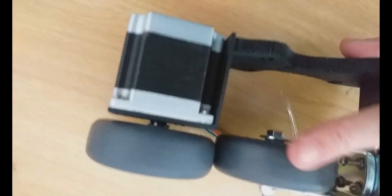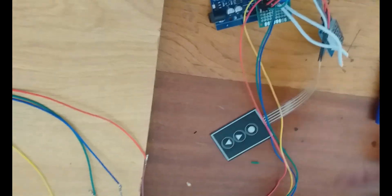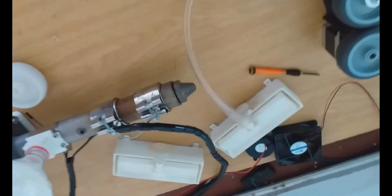The issue is keeping the filament aligned through the puller. With the vertical design it's quite easy to keep it centered, but with this orientation I need to effectively get some way to hold it - I'll probably 3D print something. It's probably going to fall out the bottom or top quite easily with this mechanism, so I need to reprint this part as well. I still need to test this today. Then there's just the electronic controller for the puller - basically a speed controller, display, and a power adapter.